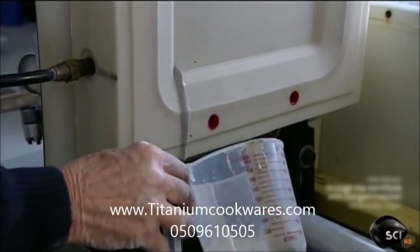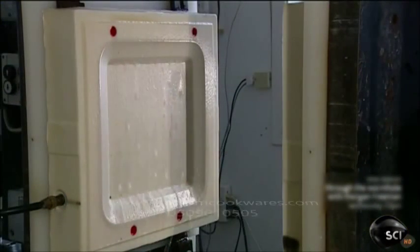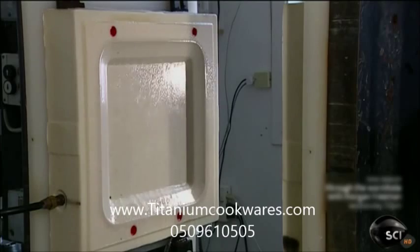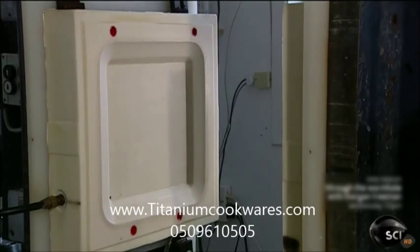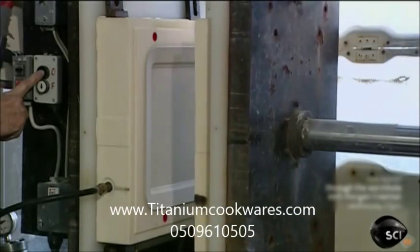They make some pieces using a pressure casting system. The mold's made of resin and tiny polyester beads that create pores which absorb the water in the slip. After a hydraulic press closes the mold, the machine injects slip into the cavity.